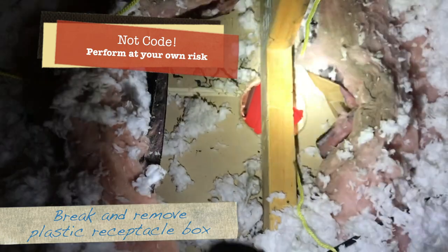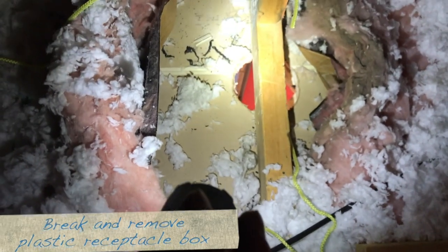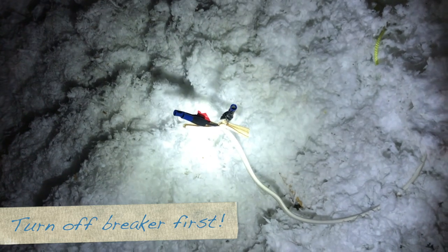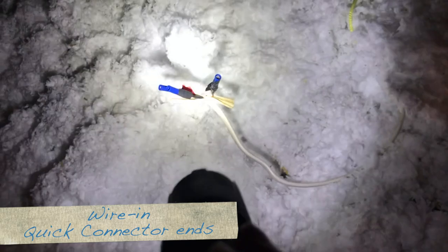You're probably wondering, well, how did I know where the chandelier was? Just like corruption in politics where you follow the money, in electrical work you follow the electricity wires. There was an electrical receptacle over the top of it — I had to smash it with a hatchet to get to it. So it's not quite code at the moment, but no one's inspecting this house and I plan on dropping dead here, so not my problem. I snipped the wires — there's the female end. Of course, you've got to turn the power off, so make sure you have the chandelier on that you're taking down and cut the breaker.